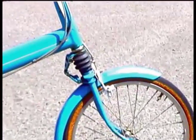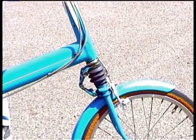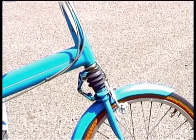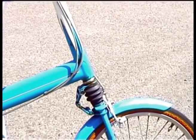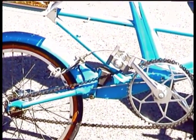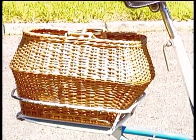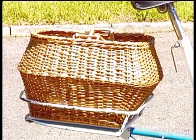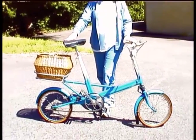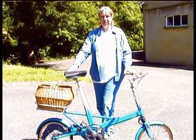If we zoom in, for example, to the front suspension there, you can see that the directional control from the steerer is provided by a hinge arrangement, rather like the sort of thing you see on the undercarriage of an aircraft. That was, of course, later to be replaced by nylon steering splines, or rather metal splines in a nylon bush. Now, if we look at the rear suspension, again, a simple kind of clapper box arrangement, not quite as sophisticated as that which was used in the final production. But there you can see a basket, again, something which appeared in slightly different form on the production models. And all in all, as we step back and look at the whole thing in totality, not a million miles removed from the production deluxes which we saw in the 1960s.